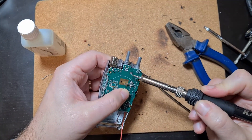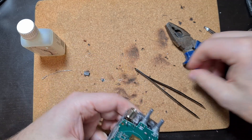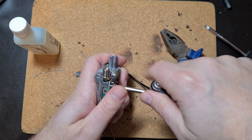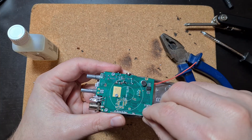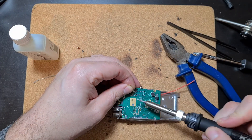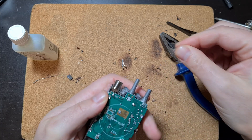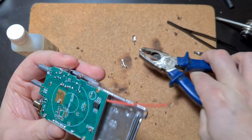With those amendments done, the PCB goes back onto the heat sink — remelt the solder to allow the pin through, then resolder it. Put all five screws back in, including the sneaky middle one, so the heat from the radio dissipates through the screws into the heat sink. Then remove the speaker wires as they're in the way. Snap off the LED from the top by wobbling it until the wire work-hardens and snaps — make sure the stubs aren't touching. Likewise, give the microphone a light twist to snap its wires off; again make sure no wires are left touching.